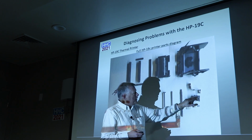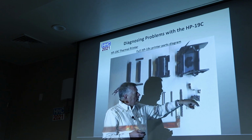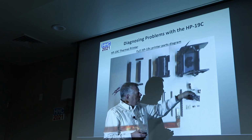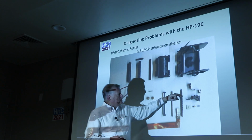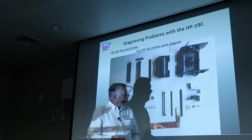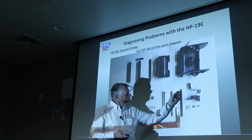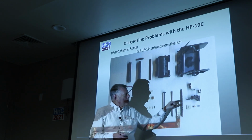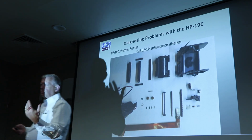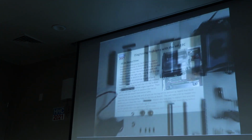This is the brass pin that goes inside the printhead mechanism. The spring goes on top of it, and it's held down by this mechanism, and the head slides up through that direction. So once you put it all back together, this drive mechanism is what keeps the printhead moving back and forth as the motor moves. So anyhow, there's an exploded view of it.